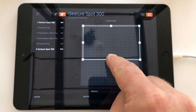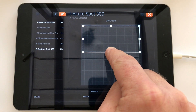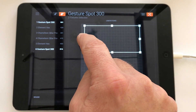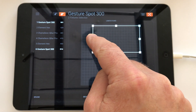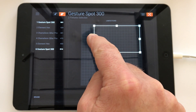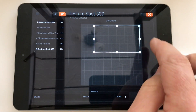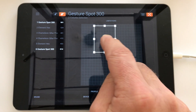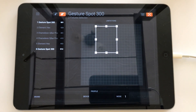The bottom line determines the highest point you want them to point — I typically have them pointing just above my head so they don't shine in my eyes. Left and right works the same way: the left boundary determines how far left your moving heads will pan, and I have them panning just to the left of my booth; the right boundary is the same. Once you've got the limitations set, your heads will be moving so you can see where they're actually pointing. You'll end up with something that looks like a small square, but from a DMX point of view, that's as far as you want your moving heads to move. LightRider will then ensure any movement is maintained within that box, so your moving heads always stay pointing at your dance floor.